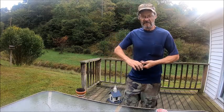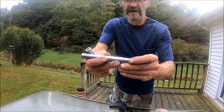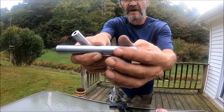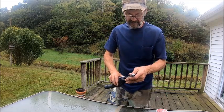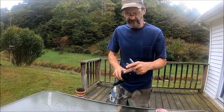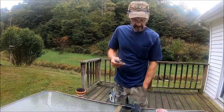Basically we just took our junk cattleman gun and cut it down and made two barrels. On this one I decided to make a flat and stamp '25 caliber' on both of them so I knew which one was 25, because it's so close in size that it actually fits a little loosely. But I think I can still use the 357 barrel band fork — it's not gonna flex that much.